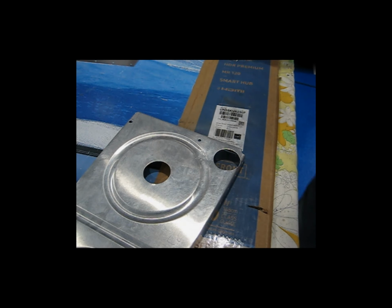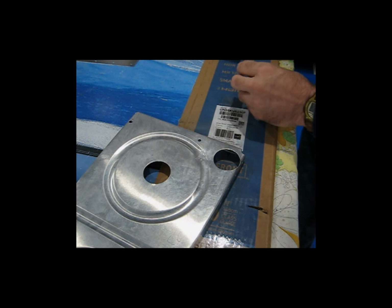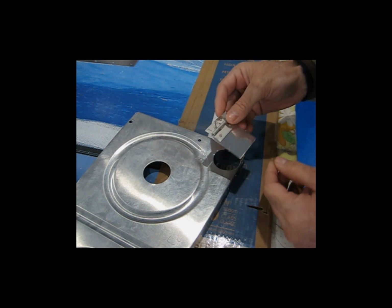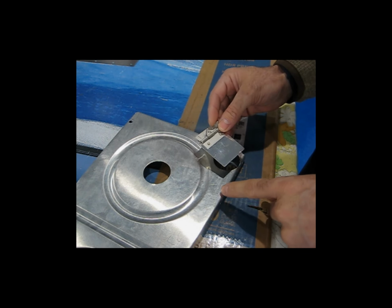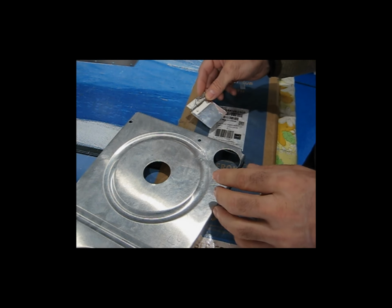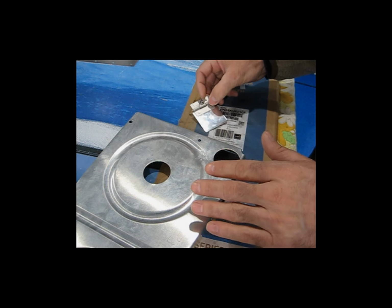I decided on my fuel system. I decided to use the standard Vans float type of fuel sender. I am not doing a flop tube. However, I am going to do these little flapper doors, if you will, for the last bay within the fuel tank. If you can imagine, the lower end of the fuel tank is where the fuel drain is located.